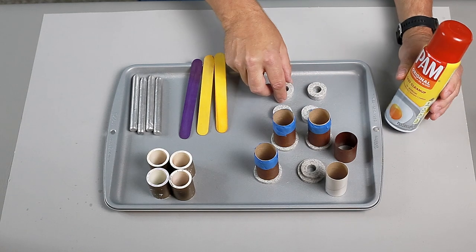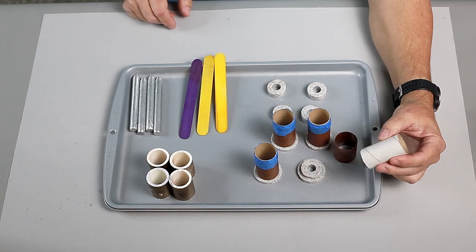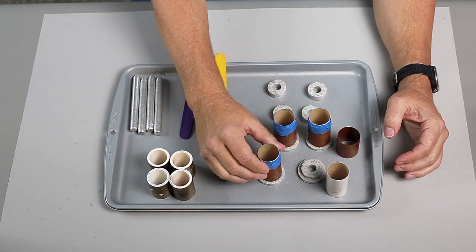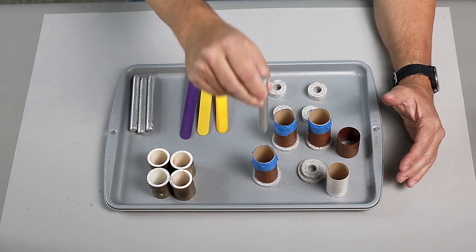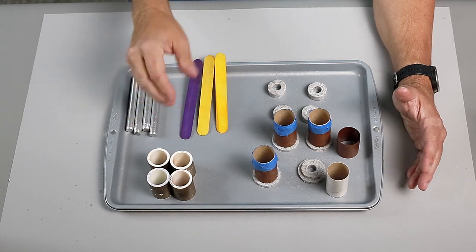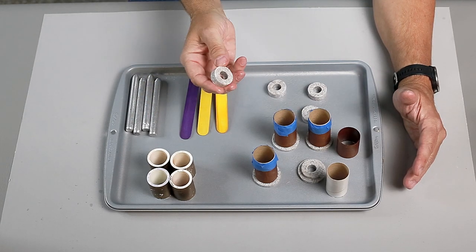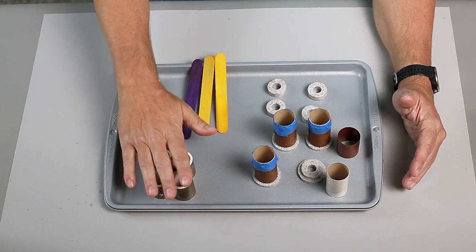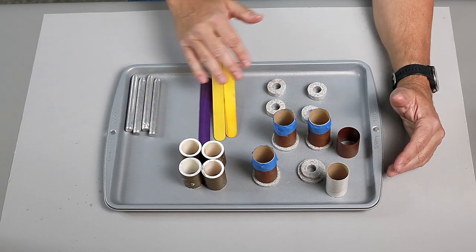I have sprayed all the tooling with cooking spray and they're ready to go. The casting tube is from Always Ready Rocketry. I'll use a piece of thermal tube that I reused, and I tape the tops because it makes cleanup easier and keeps the tubes from floating up when I push down with the coring tool. The coring tools are 3/8 aluminum — you can also use Delrin. It's a little too hot for 3D printed coring tools, but the other parts I use are made out of Corian, made on the lathe. I also have standoffs and craft sticks to manage the propellant.